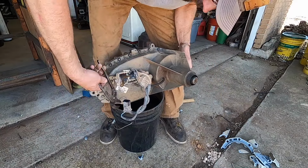Alright guys, I'm going to explain to you what's going on here, what I'm seeing, and I think this is some kind of sintered piece. I believe it's steel. I'm kind of doubtful of that even, to be honest. But at the very least, it's acting really weird. So I had it all cleaned off, and as I was welding it and it was getting hot, oil starts coming out of nowhere. This is acting as if it's porous and it's got oil soaked into it, which, you know, is not out of the realm of possibility if it's some kind of sintered piece that's porous.